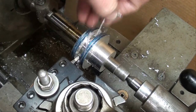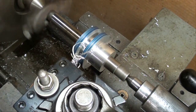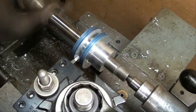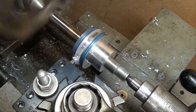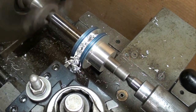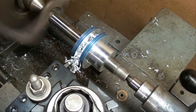The chips are sharp — I should have my hook handy. I'm going to reset my tools at a slightly different angle, then finish this side. After that we have to flip the work around to do the other side. Of course, you could move your compound off in the other direction, but then you'd also have to grind a left-hand tool, and I don't want to do that.